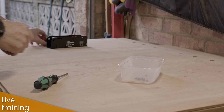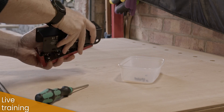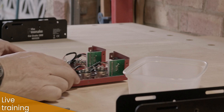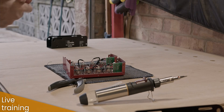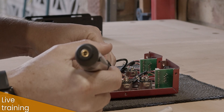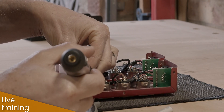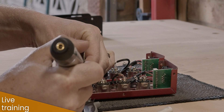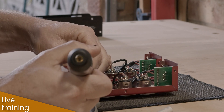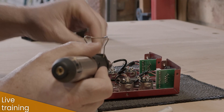You take them apart and the front plate just lifts out — you need to do that for both sides of the pair. What you're left with is a bunch of connectors on a circuit board. It's relatively simple electronics, but we're going to unsolder two of the connectors. Make sure you do the same two on both sides. The connectors are numbered one, two, three, four on the fronts — make sure you do connectors three and four from both boxes. You don't want to solder male to male and female to female — that won't help you.